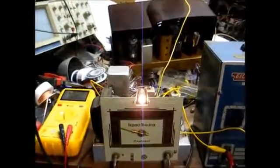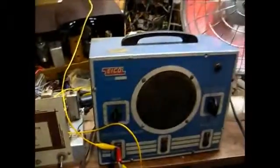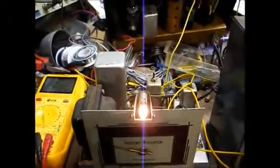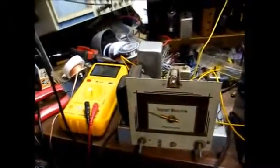Okay, tomorrow I want to hook this to a somewhat decent amp that will give me a little bit better fidelity than this signal tracer, and that'll give me a better idea of the current condition of this thing. And I'll clean the tube sockets to where they'll make better contact. I might even replace the selenium rectifier with a diode and kind of touch up the alignment, and this thing ought to be good to go.